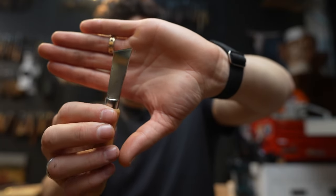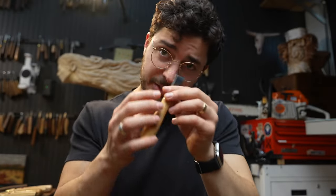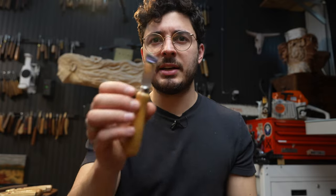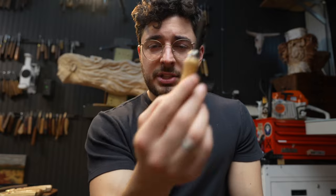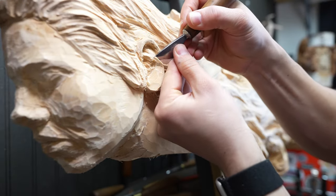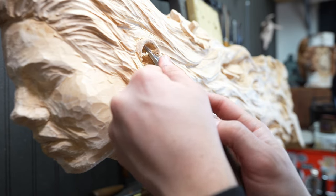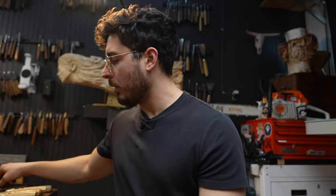The skew stays out of the way — for instance, if you're going around the eyes, it's so easy to use the knife to bump into the nose on accident, and the skew does not do that. It gives you a straight shot into the areas that you need to get into. Hard to explain, easy to see the difference when you start using a skew regularly. You can do paring cuts, scooping cuts, a whole host of things. I recommend it — it's an awesome tool.